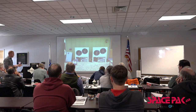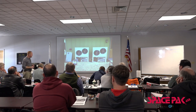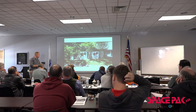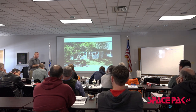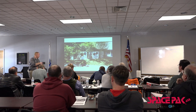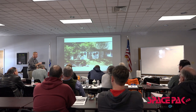Many systems are multiple units, just a couple of them, two or three tied together. And again, they can either be tied together daisy chain style, so when one comes on, they'll all come on. Or we have a staging control that'll say, okay, this one's going to come on. If we don't hit our set point within 2 minutes, we'll call this one on. If we still don't hit our set point within 2 minutes, this one will come on, and so on and so forth. Right? So there's a way to tie them all together. It will also monitor the runtime. It won't change every single time to what number one is, but say this one gets 2 hours of runtime. Once that gets 2 hours of runtime, then it'll give this one 2 hours of runtime, and so on and so forth, right? So it won't alternate the units every single time it turns on, but once it gets a specific predetermined amount of runtime.